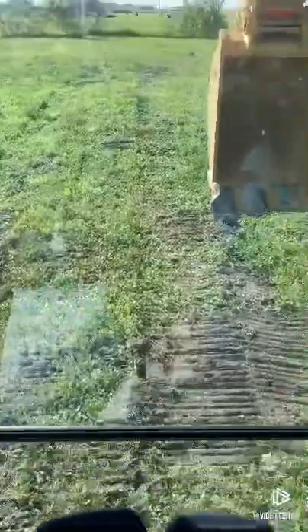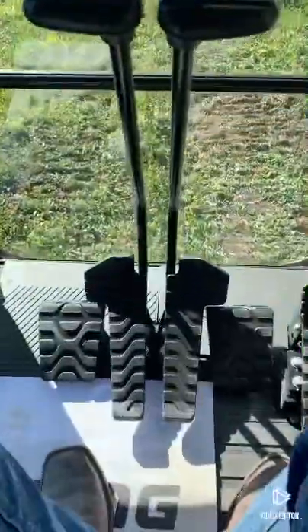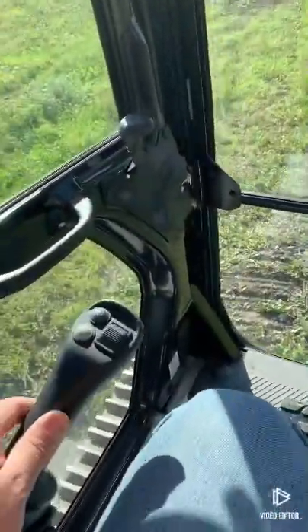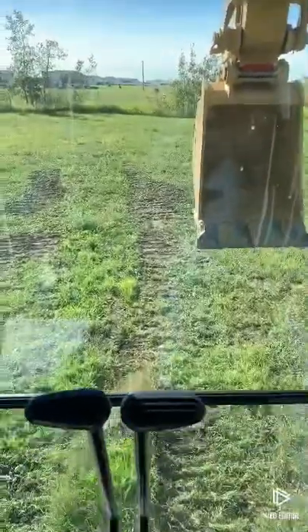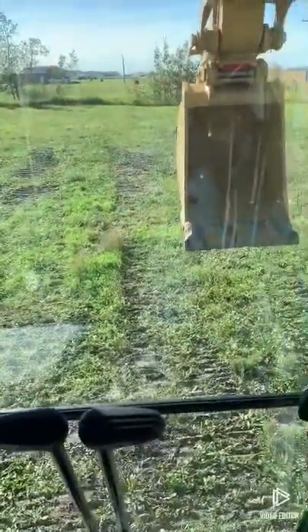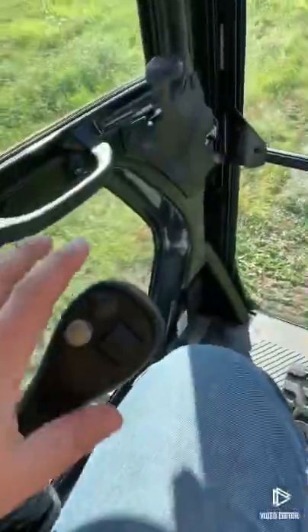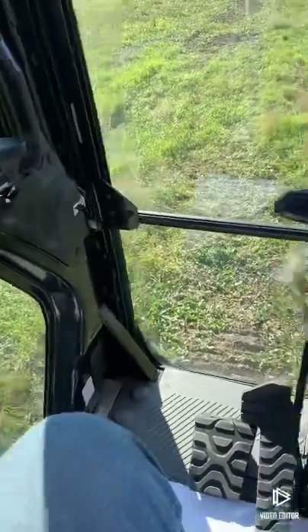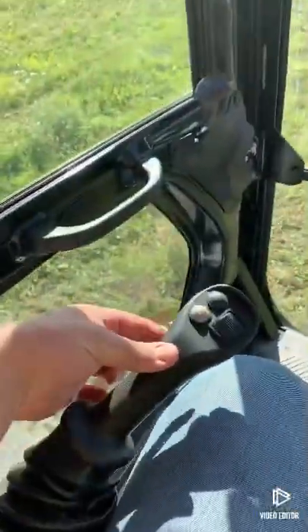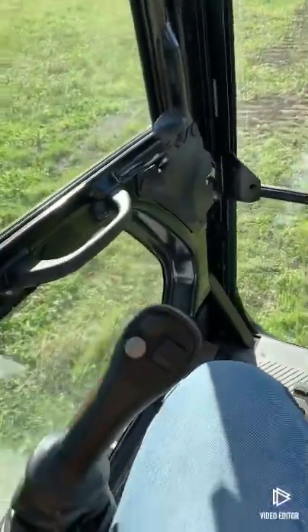You can see we're tracking ahead without using the foot controls. To steer left and right, no problem — just run that joystick left and right and you can steer on the fly. To go backwards, run that joystick backwards and we're tracking in reverse. If you're on a really long straight haul and don't want to hold the joystick forward or run your feet on the pedals because your feet get sore, that's where cruise control comes in. Get tracking forward on the left-hand joystick, then click the bottom button on the back.